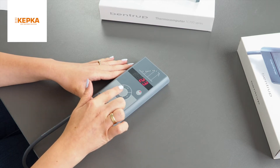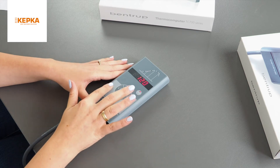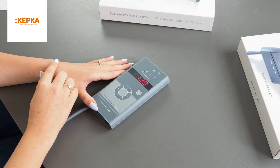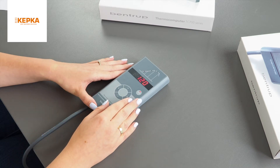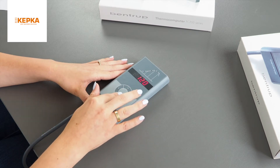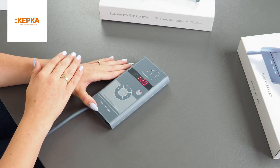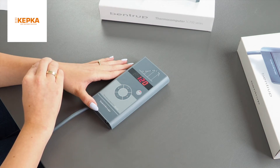Use the arrow keys to go through segments. The first segment is controlled heating up to 580 degrees, and this is the temperature which is already programmed. In this example, I want my kiln to heat up within 120 minutes to 580 degrees.